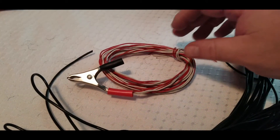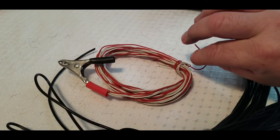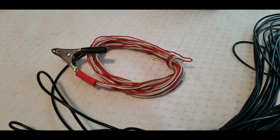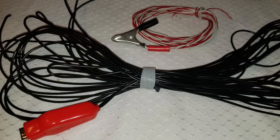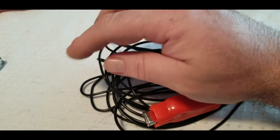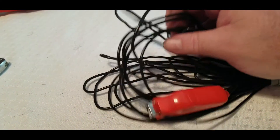I also wanted to make some new radials. The original radials were pretty nice — they had ring terminals — but mine had a terrible accident with a lawnmower. The cheap replacement ones I made functioned fine, but the solid core wire has a memory, so whenever you bend it, it wants to stay that way, which wasn't optimal for radials. So I bought some wire from DX Commander — Callum McCormick in the UK — who sells very nice wire called DX10 that doesn't really have a memory. It's very flexible and nice in the hand.